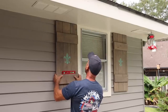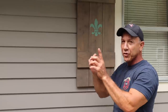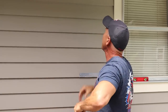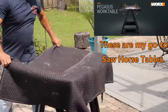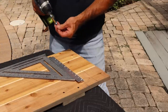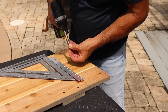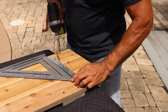I'll put it to the height that I want, close to the ceiling — we're on the money right here. Carefully, don't just yank it; just slide it right off. The shims will follow — no big deal — but everything else is intact. I'll place my square up against it and you can see I'm on the money, meaning my level was on spot. Now I'm going to put my screws in.